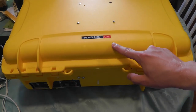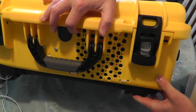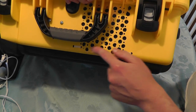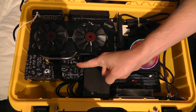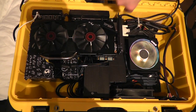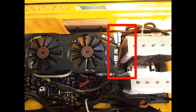For this design, I went with the Nanuk 935 instead of other cases specifically because this one was thick enough to fit some small desktop fans. But I kind of screwed up when trying to figure out the right layout for the venting holes. Also, because there are wheels, I had to work around the weird plastic bulges inside of the case, meaning that there was only one possible orientation for the power supply, and that the GPU had to sit on top of that. This also meant that I couldn't use my more powerful Noctua fans, as there was no way to plug anything into the GPU if I did that.